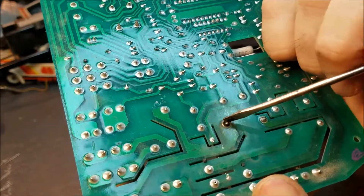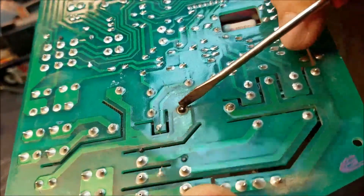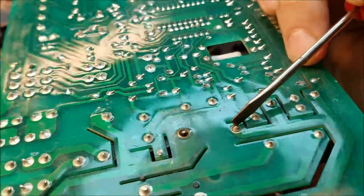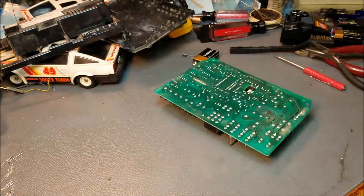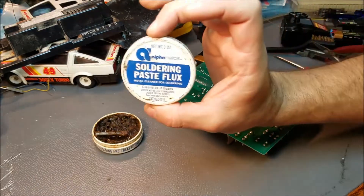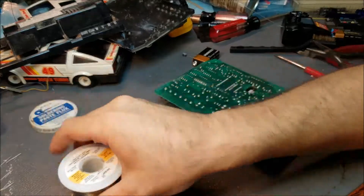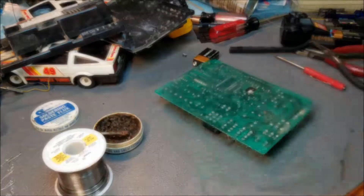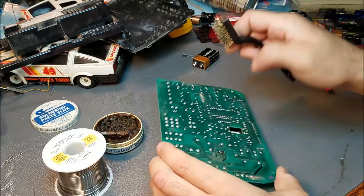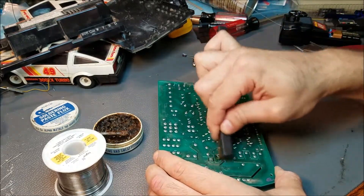And as you can see here, the joints on the back of the blower relay are very obviously broken. Fortunately, that's a very simple fix. Now the backside of this board is potted in a gelatinous material, but it comes off very easily with the wire brush.